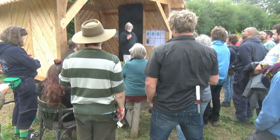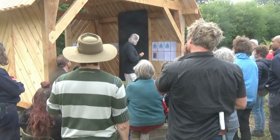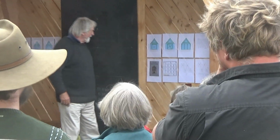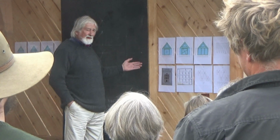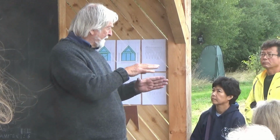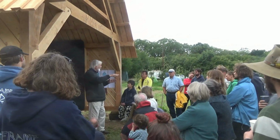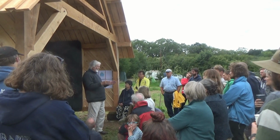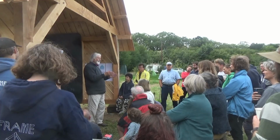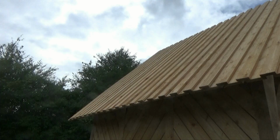One of Nigel's instructions to me was, consider small timbers, okay? Now, when you get time, come and look in here, but this is the cover of a book, a modern facsimile, by Sebastiano Serlio, Italian. Serlio's problem was a carpenter was asked to frame the joists to hold an upper floor in a building. But, like Nigel, they said, we haven't got any timber that will span this distance. So say it was a 12-foot square, they'd only got 10-foot timber. How can you frame the joists for an upper floor using less than adequate length timber?